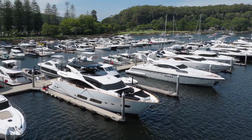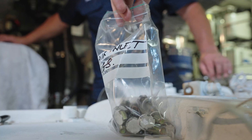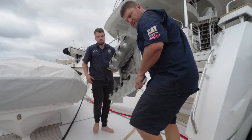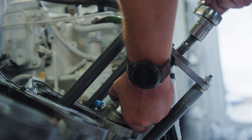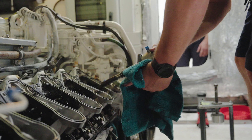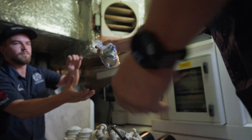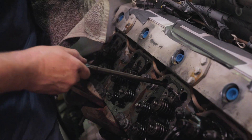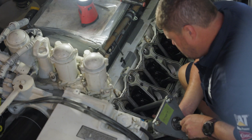Once we've protected the vessel, we go to the engine room — draining coolant, pulling off brackets, and getting set up for the next stage where you're removing big parts. As a wise man once told me, big parts win hearts. But it's important as you're stripping down the engine to inspect all the parts and make sure you're changing them for the right reasons, with no underlying issues you may not have known about. It's difficult with an engine — you don't have x-ray vision, so you don't find a lot of these problems until you actually pull the engine down or remove one component to look under another.